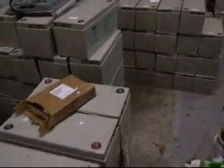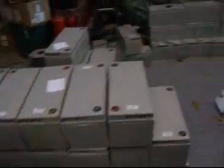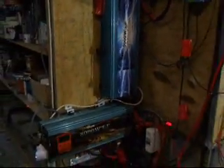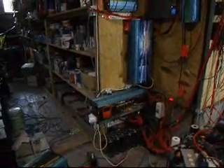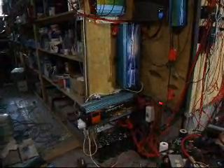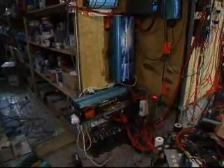The main battery bank has been working through a Power Jack 8000LF, and that has two transformers in it, to which I've added a third from a spare unit. So it's the equivalent of a 15000LF, and that powers up to a 30-amp ring main in the house.